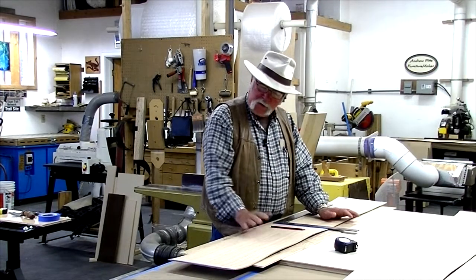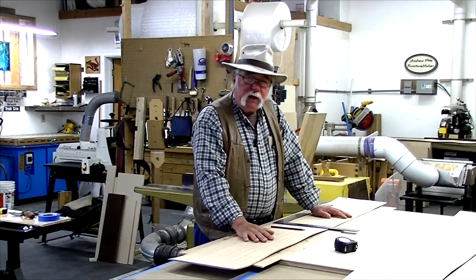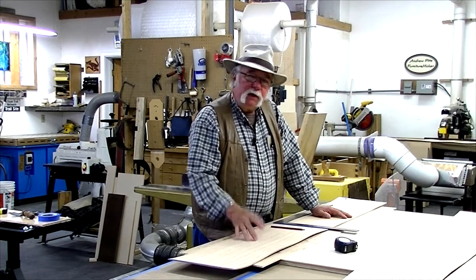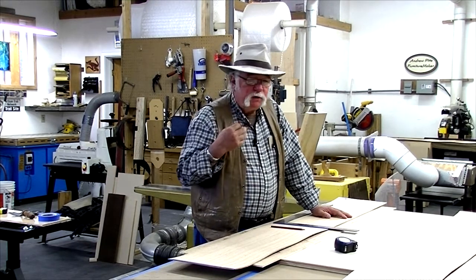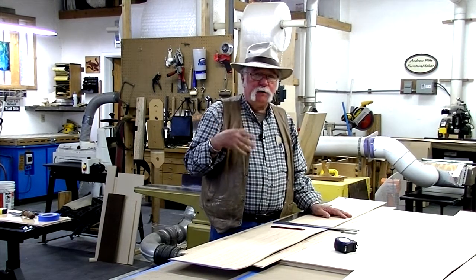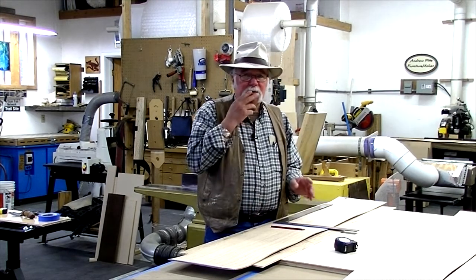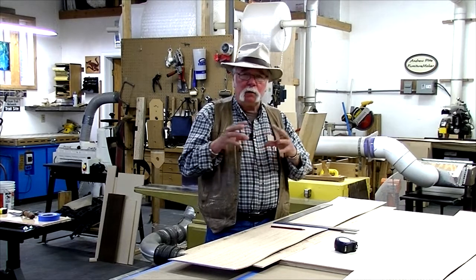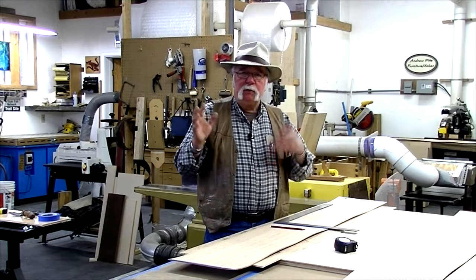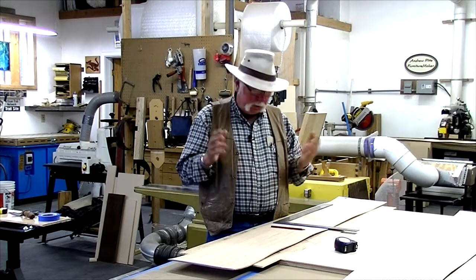Okay, so for the show veneering, I've got my rift sawn veneer laid out. I laid out all 9 sheets and I marked where I think the cuts should be. I have enough to do the fronts and backs of each panel for both the altar and the pulpit. And you veneer both sides because the veneer can actually pull on the wood with moisture changes in the atmosphere. So you want both sides to have the same pull so your piece doesn't distort.